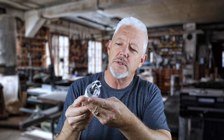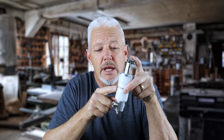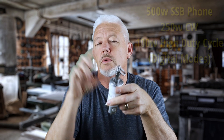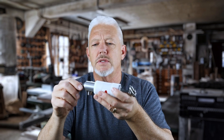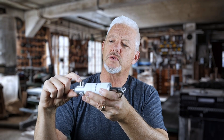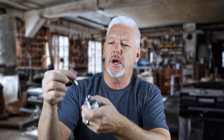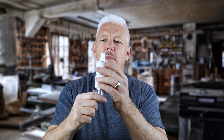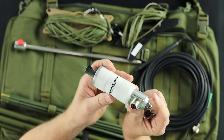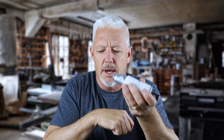Next on the list is the hybrid micro. This is the five-to-one transformer, and this is what's going to get our antenna to match the different bands. The micro is the smaller one — it's good for 100-watt sideband. There's also the mini, which is the larger size for higher wattage. The part of the hybrid micro is the nut that goes on the bottom, and this nut coming off is going to serve a purpose for us later on. Here's where your coax goes on the SO239, and the top has the shackle.